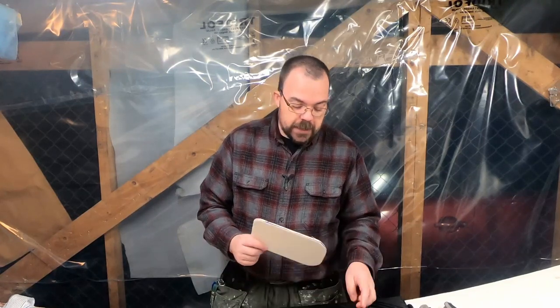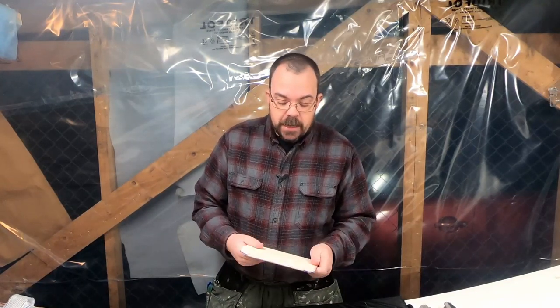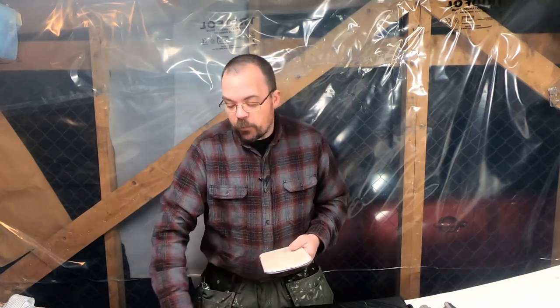They need to be fiberglassed, and as you know, the edges are rounded on these ones, and I want to have fiberglass all over it. That's why I'm gonna start with a 300 gram fiberglass layer cut into strips. The first strips are about 5 centimeters going around the edges and overlapping, and then a second layer that is 1 to 2 centimeters thinner or narrower. I need to saturate the edges and the top part and let that sit for about an hour or something like that before I start to put on the strips.